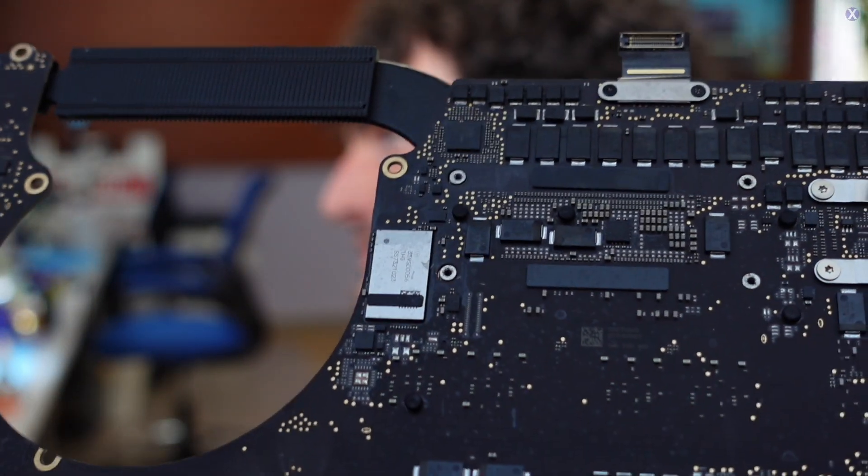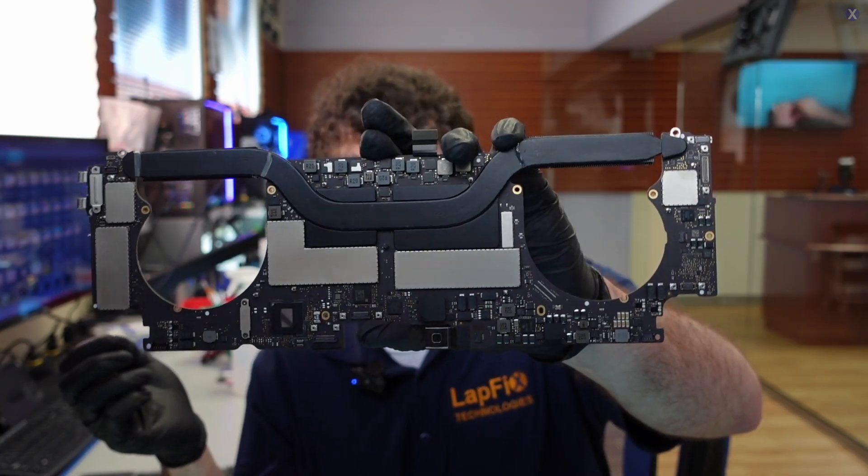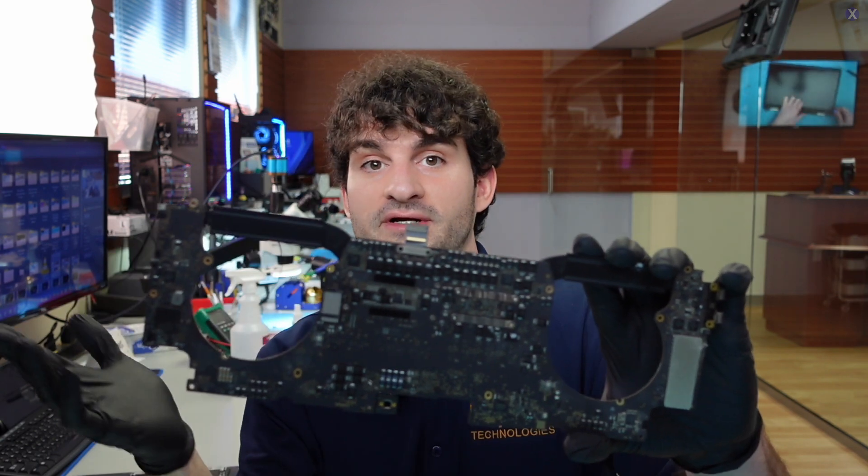We cleaned it up and it looks pretty good now. Let's go ahead and see if our MacBook is charging — we'll take our USB-C tester and see if there's any change in behavior. We're still getting our 5 volts and 0.2 amps, so we still see that same short. So what's the next step? We're going to use a thermal imaging tool. Just pretend this is a big city — we need to find the culprit, one guy hiding somewhere who's causing everything to fail.